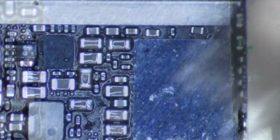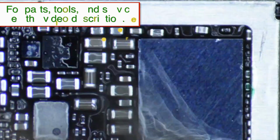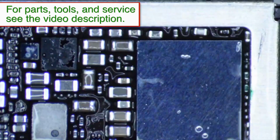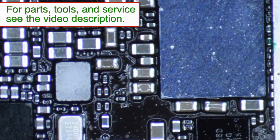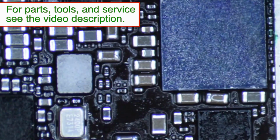You'll want to watch here. I know I'm sort of blocking the camera a bit, so I'm going to show this twice, but watch the chip. If you didn't see it wiggle just now, I put it in slow motion for a second take, and you see it just shift there. And when it does, that was because it sat down on the balls. I gave it a small nudge to make sure that it bounced back into position, and now we are aligned properly. So we'll go ahead and clean all of this up. It's much easier to get the flux off, obviously, when the board's a little warm. Once it cools, it gets kind of sticky. So I would do that as soon as possible.